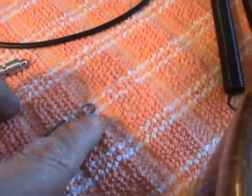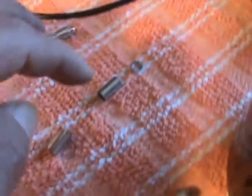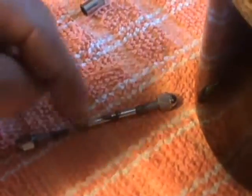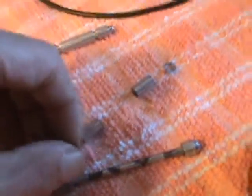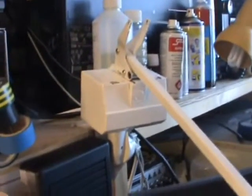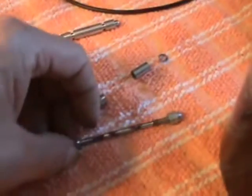So what I'm going to do is, instead of it just having this washer here, if there's enough space coming out at each side, I'm going to put some spring washers at each side, and slightly grease the whole thing, just a little bit of a lick of grease. Then I'm going to try and get it under compression with a spring-loaded arrangement at each side. Also, when I move it in future, it'll be in my brain all the time that that's a weak part, because sometimes I just grab it. Anyway, so we'll carry on.